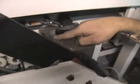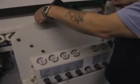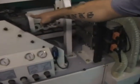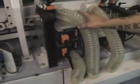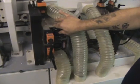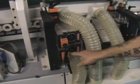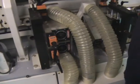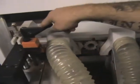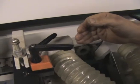There are 2 of these saws. This one here does the front edge and this one here does the rear edge. This unit here is your rough trimming head. These two here adjust the heads in and out. These two here adjust the amount you take off by adjusting the tracing wheel up and down in relationship to the cutter.